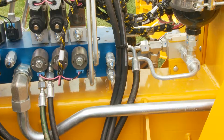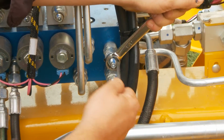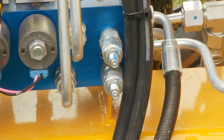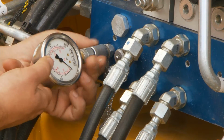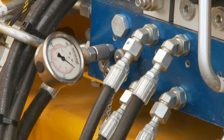The Oxbo merger easily adjusts to varying ground conditions by adjusting the float pressure. This makes the header place more or less weight on the skid shoes based on your preferences. Factory setting is at 1200 psi on all three heads of a 330 and 1300 on the wings of a 334 with 1200 in the center.